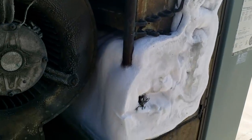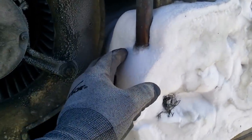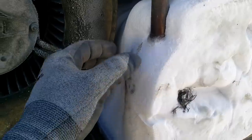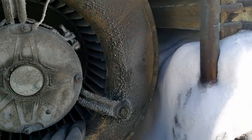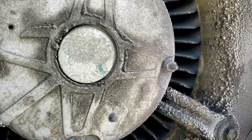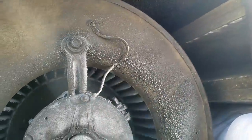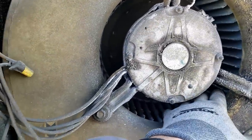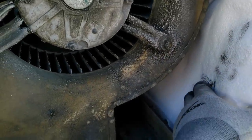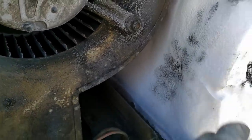We're just slightly iced over here — makes a nice ice machine. The fan blades are just a touch dirty. The bearings feel good though — nice smooth turn left and right. So it's going to take a little more than just a little bit of heat; this has been going on for a while.